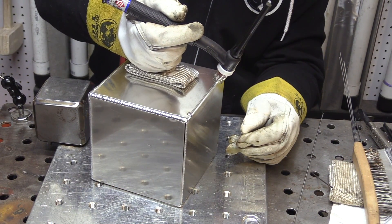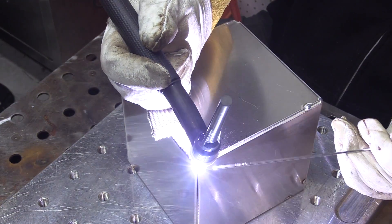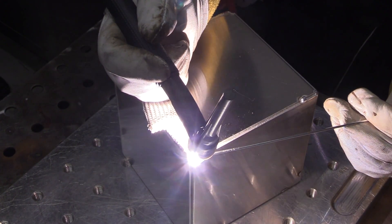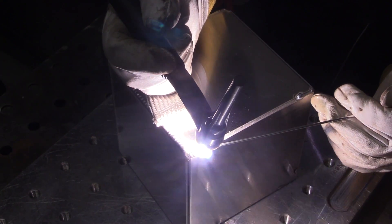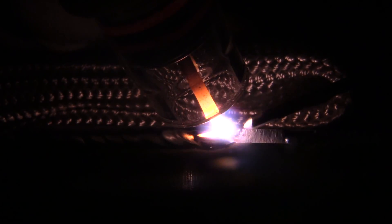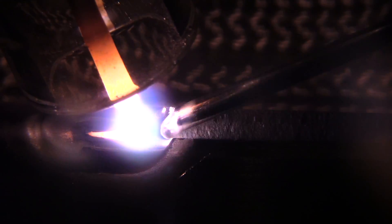I'm just going to glide along here and weld the joint just like before, just a little bit different method of propping — instead of propping on that little steel block I'm going to do the slide and glide. Usually there's some way to prop on something, but sometimes it's difficult, especially on aluminum when it gets so hot. One dip per eighth of an inch and trying to travel about an eighth of an inch between dips too — that's just a rule of thumb but it sure does give you some consistency.